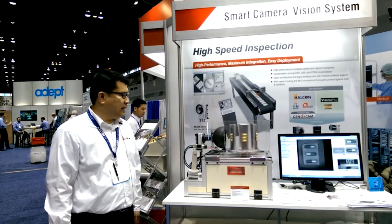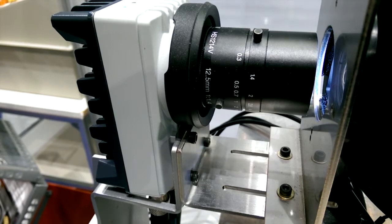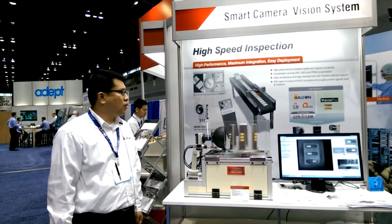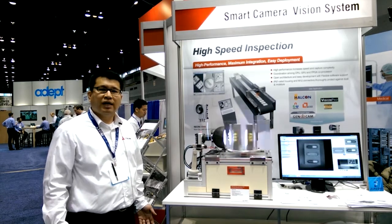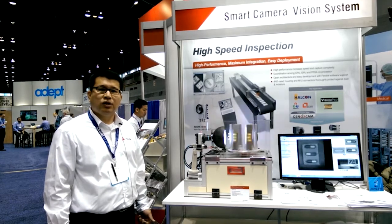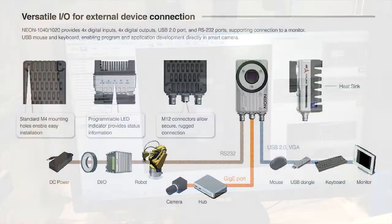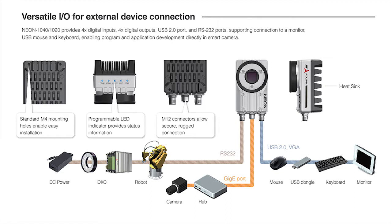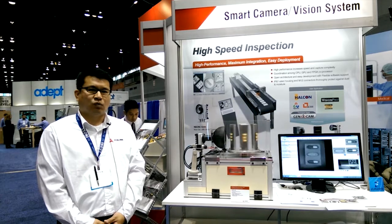If you look inside the camera itself, as I mentioned, it has very superior computing processing power and it is also surrounded by many IO features. That will get you an additional Ethernet port which will allow you to have another connection to either a slave camera or any type of barcode reader. The camera itself has superior IO features which contain serial ports, USB ports, along with a VGA port that will allow the camera to be connected to HMI interfaces as well.